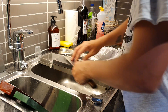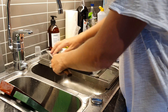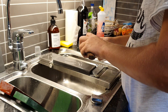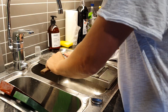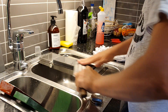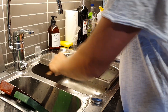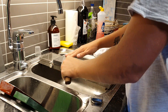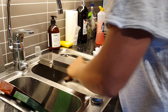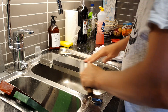Raising to around 12 to 15 degrees, just kissing the stone — this is just refining and putting a tiny microbevel on it. Just putting on the tiny microbevel for strength, nothing more. On such a thin blade it won't hinder performance at all; it will just make sure the edge doesn't chip, crumble, or roll. When I'm stropping I strop at a little lower angle, so I'm actually rounding the shoulder and blending that microbevel back in.